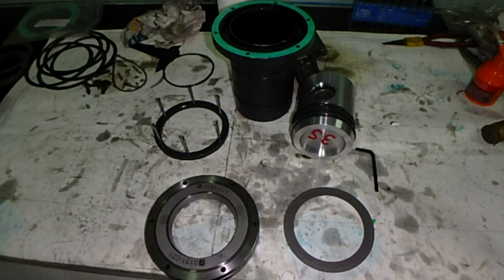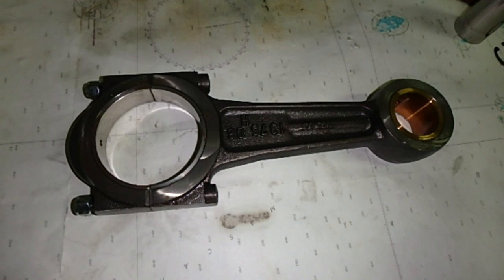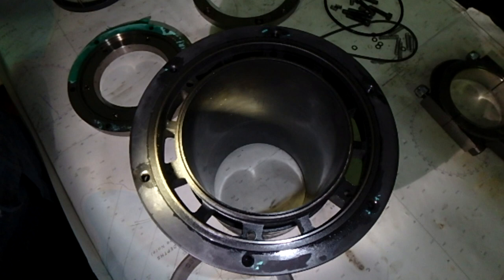And as I remember, we also replaced one bearing, because we found that the bearing had some scratches on the bottom and that was the reason for the replacement. As you can see, this is the nut here that was modified, and this is the rivet type that this brand of air condition, Sabroe, has made. This is also the part that broke. This is the holding of the spring that you saw before, which is broken, and some parts remain there.